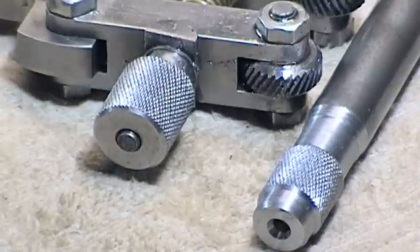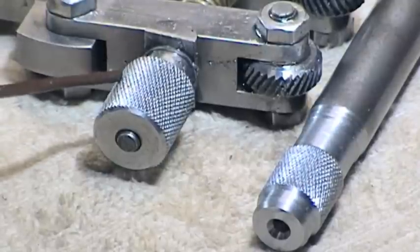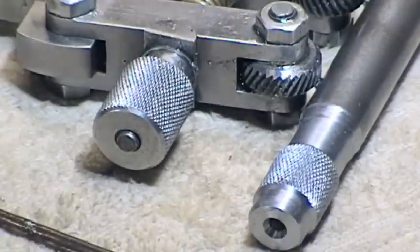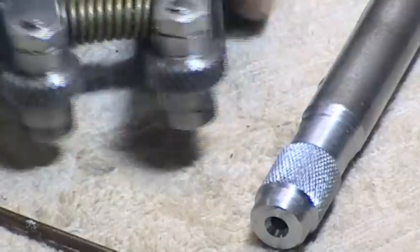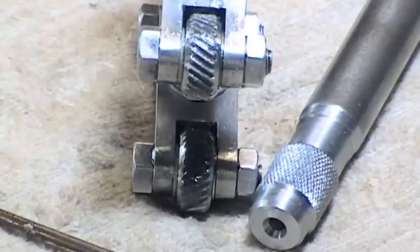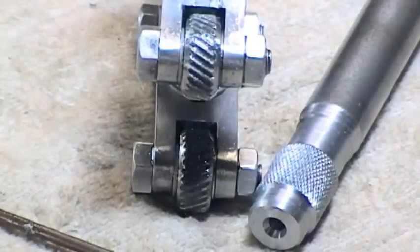Final afterthought: the knurl on this knob here was done with this same setup because the knob was made to replace a temporary one, and you can probably see that it's the same degree of knurling. If the initial bite is made very aggressive because the wheels are coarse — you can see how coarse the wheels are — it's possible to keep the pattern and get a larger, coarser type knurl. It's down to what's required, but the end result is quite satisfactory.